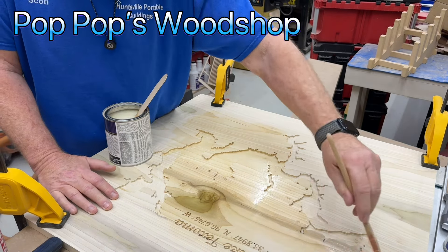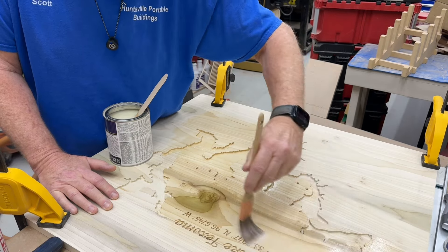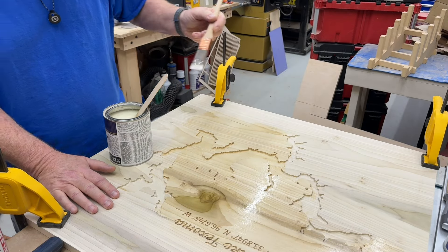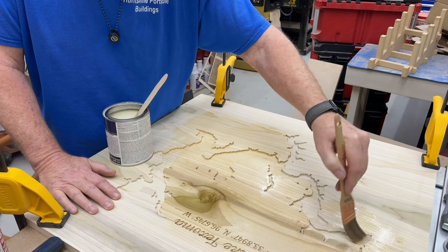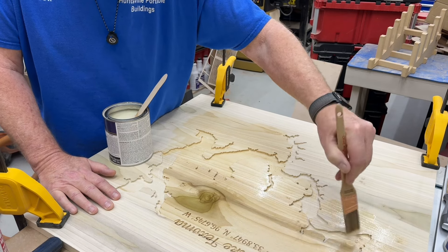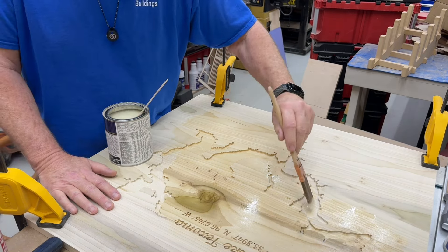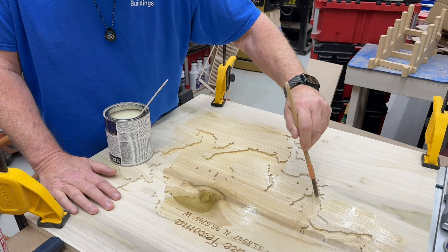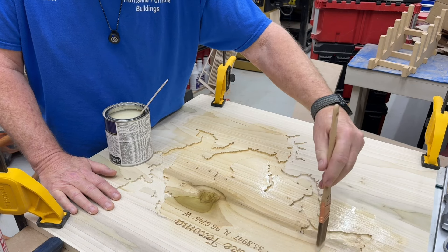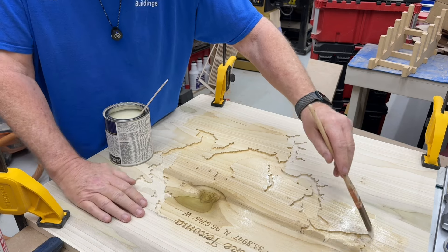You can say 'just pass that cost along to the customer,' but that just makes the project more expensive and it's getting more and more difficult. So what I've done is I have a brushable Deft sanding sealer in the can and I'm putting that on. I'm going to put a couple coats on, and then later today when it's dried for at least a few hours, I will epoxy fill all the lake with blue and the wording in black.